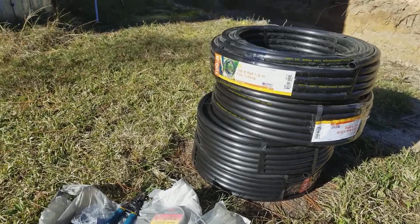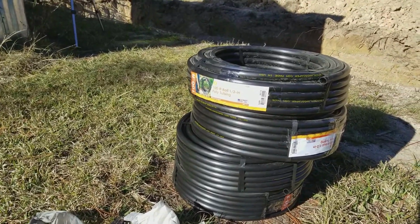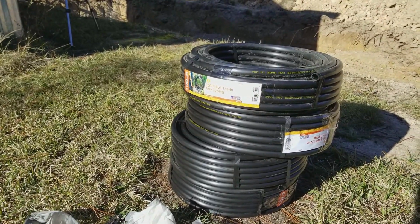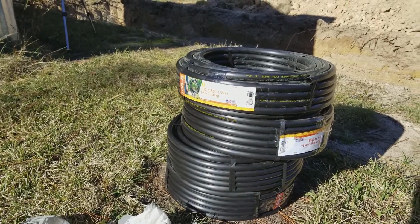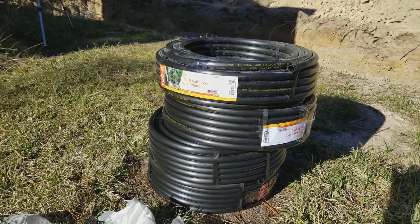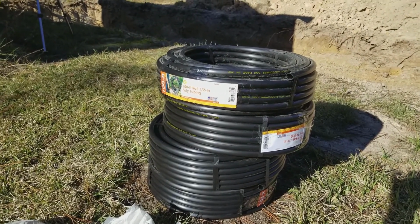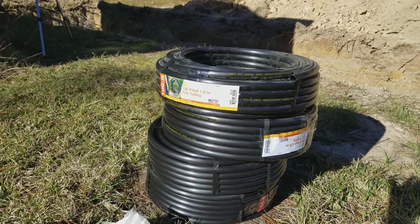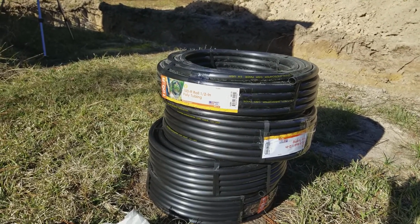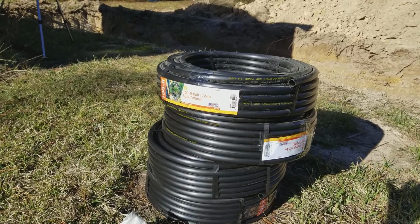The other 200 feet, I got an idea. If this don't warm enough, what I'm gonna do is set up a compost pile of some hay. I was gonna run some of that tubing, just the whole coil, kind of separate it some, and run it inside the middle of the compost pile. You let that hay, as it starts decaying, heat up, and just wrap it in a tarp and let it heat up and heat that water up.